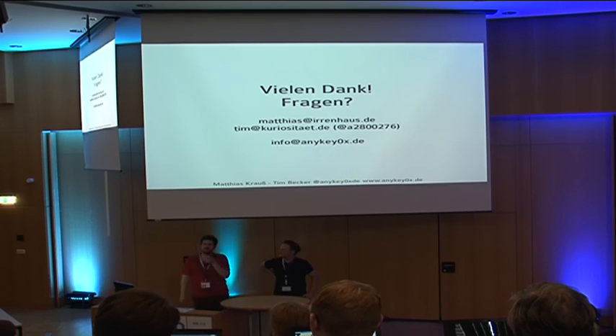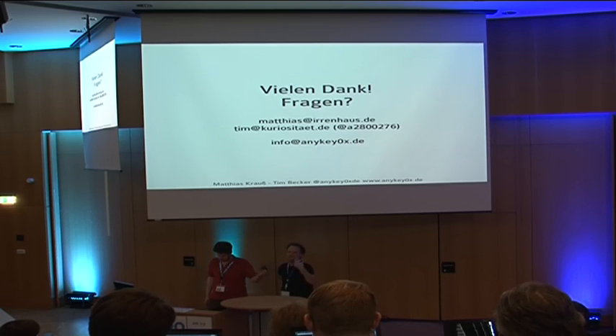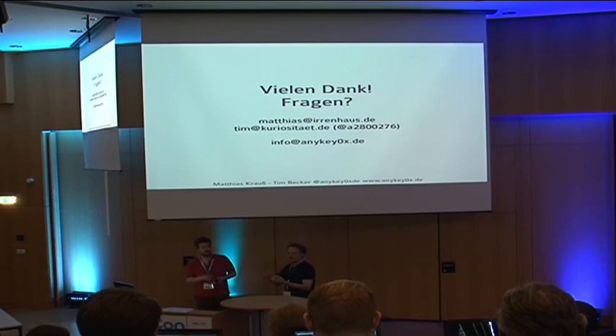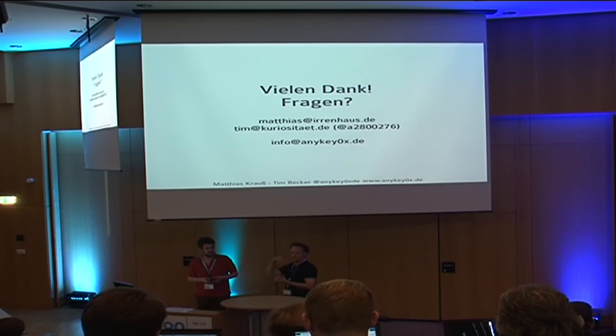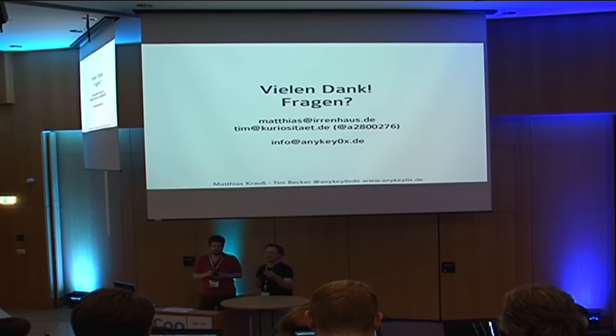Question: does it have a self-healing fuse like the Arduino? A self-healing fuse is a protection mechanism that disconnects when there's overcurrent and reconnects once conditions cool down. It's a nice thing to have, but this design is inspired by a minimum design philosophy — there shouldn't be anything unnecessary on the board. There are a thousand different ways of destroying the board and this would eliminate one of them, but you can't make it completely safe anyway. It's meant to be how industry would do it — saving each component. If you want a fuse, you can just take the schematics and add one yourself.